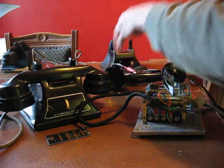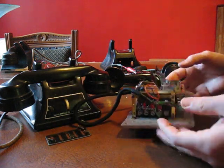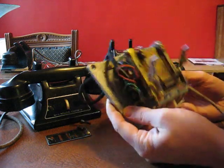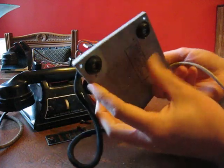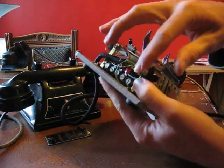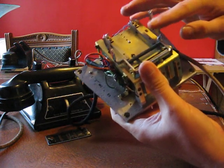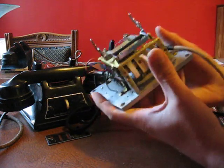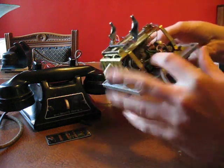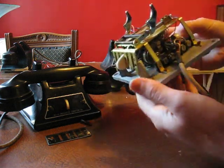Once you know how to do this it's amazingly simple, but it's just initially trying to work it out that was not the easiest. In terms of the design inside, it's quite simple — just a big lump of aluminium as the base chassis. There's a small sub-chassis screwed onto the top of that, a couple of hook switches activated by plungers, and a buzzer down at the bottom. You can actually adjust the buzzer by tightening a screw to change the tone of it.